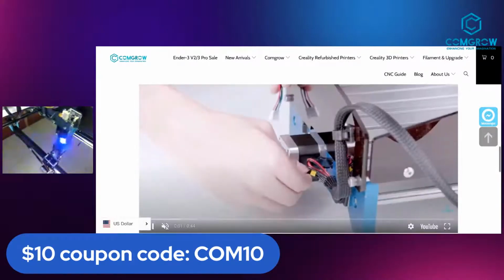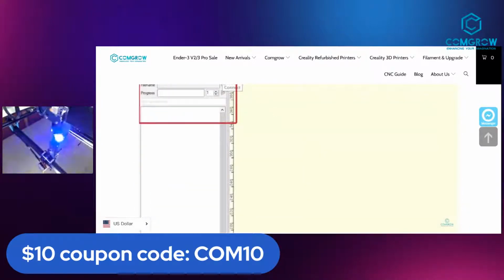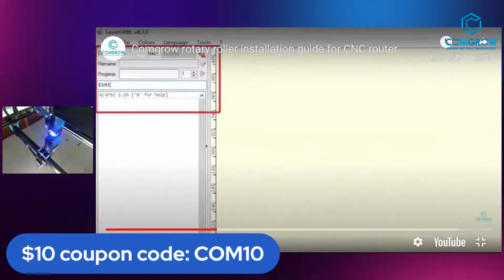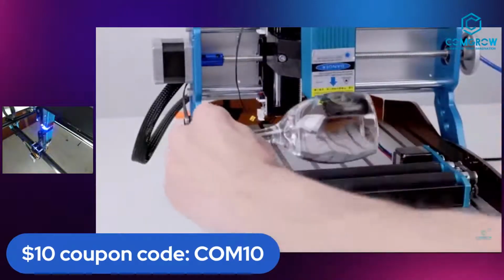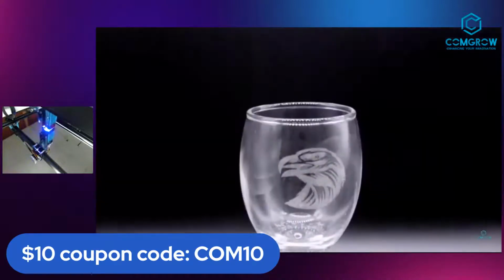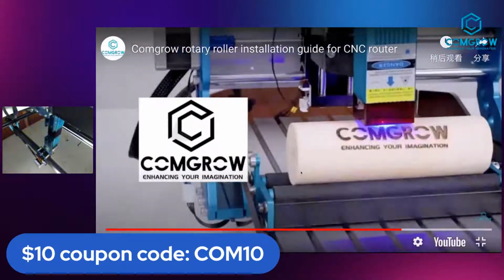So also we have the guide for CNCs. So do not worry if it does not have the tutorial for the laser engraver, we have this all covered. This is for the people who have the CNC router here. For the glass, you can notice that we use the black pen to make the coating first. So if you want to engrave on glass, even for the 5 watts, you need to coat it first, or even use the laser engraving paper.